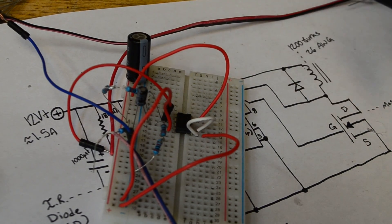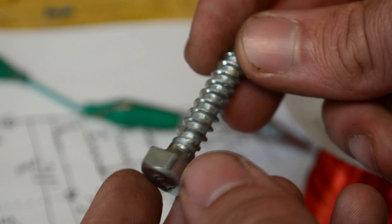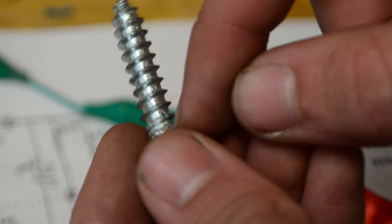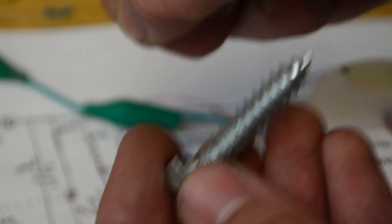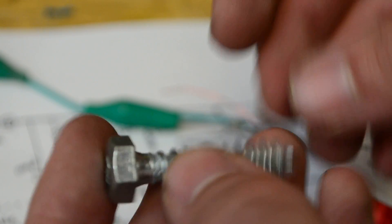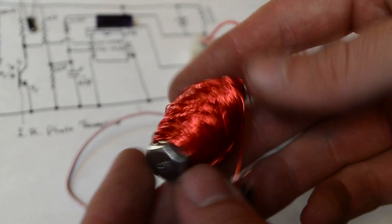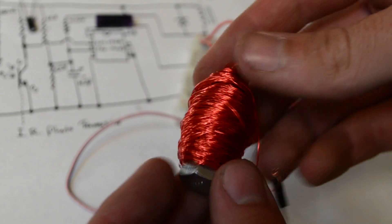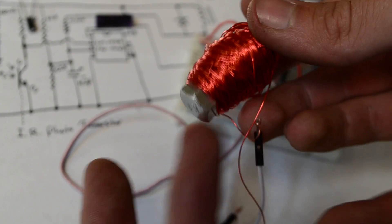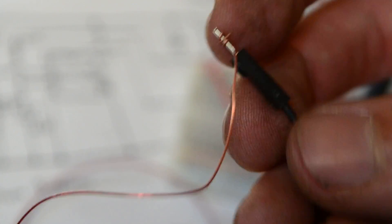First, we should probably make the electromagnet coil. We're basically going to be coiling enameled copper wire around a piece of metal. To create a more powerful electromagnet, I'm going to be winding 26-gauge magnet wire around this bolt. An important thing to remember is that when you get to the top of winding, you should bring it down and then wind up again — if you wind back down in the opposite direction, it'll actually make it weaker. Here's my electromagnet. It has approximately 500 turns of magnet wire wrapped around it. I did want to get somewhere around 1,200 turns, but I didn't end up having enough wire. So this will end up being less strong than it could have been. Be sure that on the two ends of the magnet wire, you sand off the enamel coating so it'll be able to conduct.